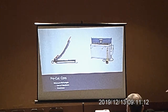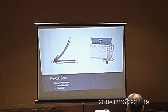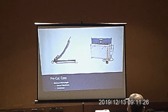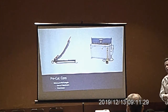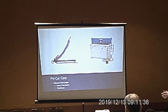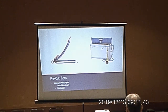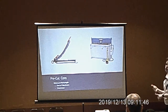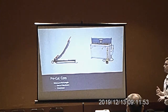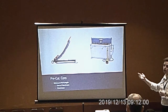The main con you'll run into, no matter who you are or where you are in the country, is minimum part length. Usually the minimum part is going to be 3 feet on a pre-cut line — here we have a manual shear and an automatic shear. So if you need to run anything under 3 feet, you'll have to take panels to a side shear to cut them down. The con is the cost of that additional machinery — not $100,000, but something to factor into your budget — plus the time and labor involved. If you need 52 two-footers, you'll have to run panels and take them to the side shear to cut them down.